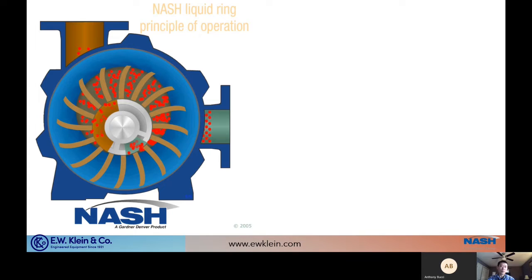Anthony, you and I are pretty familiar with the Liquid Ring Vacuum Pump and how it operates. So let's give everyone a refresher. This is a cross-section of it. The Liquid Ring Vacuum Pump has a circular housing, then a rotor assembly that's off-center from the center of the housing. This blue ring here is actually the liquid ring — most applications would just use water. I wish the animation would start where it's not turning and the water is just half-filled in the pump.